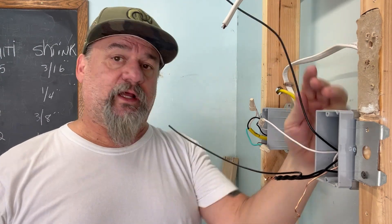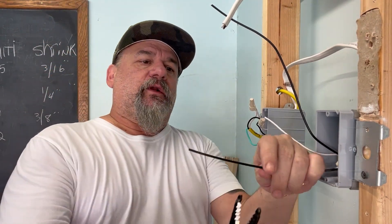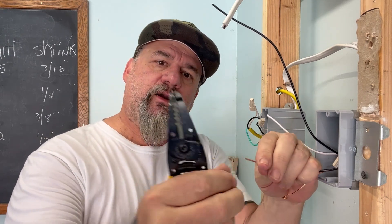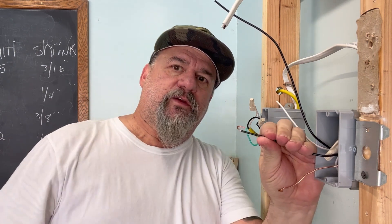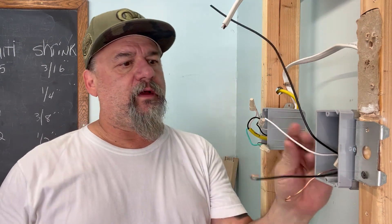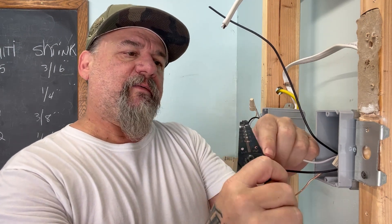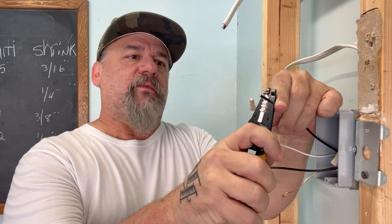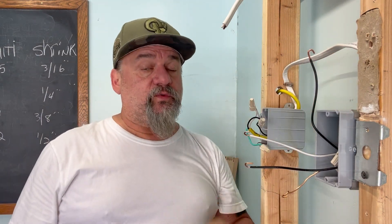The neutral is already up there, so now we have the switch leg. Let's hook up the switch plug combo. First, trim all our wires back to about an inch. Use the little holes in the strippers, put the wire about halfway down, twist, and put a nice curl in the wire. Do the same with the neutral. We do this because these don't have stabs in the back — some people don't trust the stabs. Get them all twisted so we can start hooking up the combo.